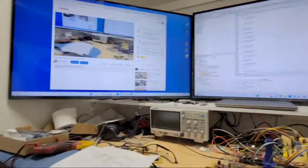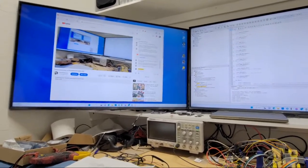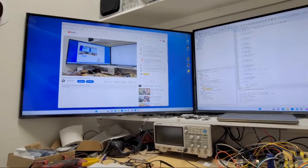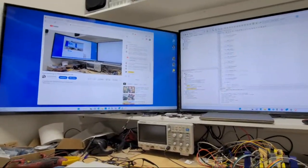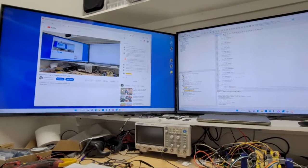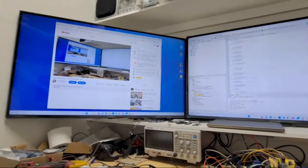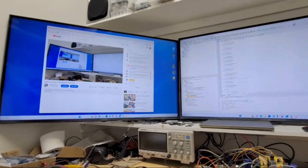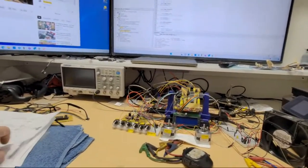On that axial fan, I need to get myself one of those tachometers or build one and put a piece of tape on one of the blades and then see what the actual RPMs are. It's pretty fast. And who knows? Those come out of the Carrier units, so I don't know if they have it listed in their product data, because I know it actually does for the fan motors, because it's telling you what to set the blower wheel RPMs for a CFM, and you're multiplying or dividing with the pulleys. So they probably don't tell you what that RPM is. There's no reason for them to, but it seems like it's pretty fast.